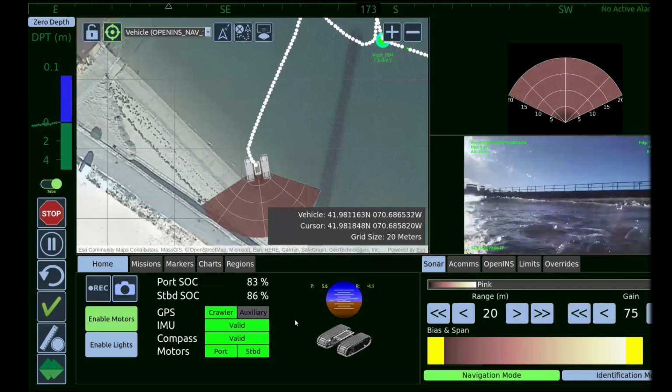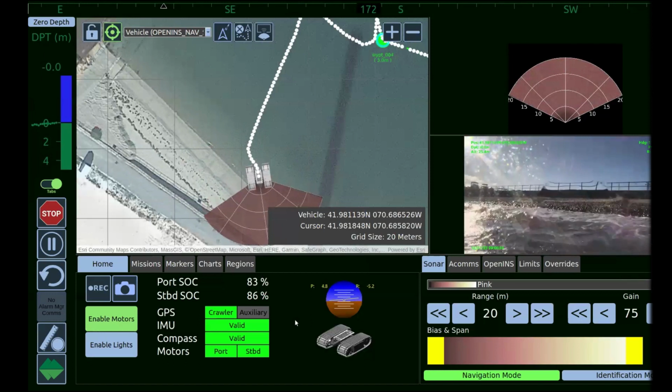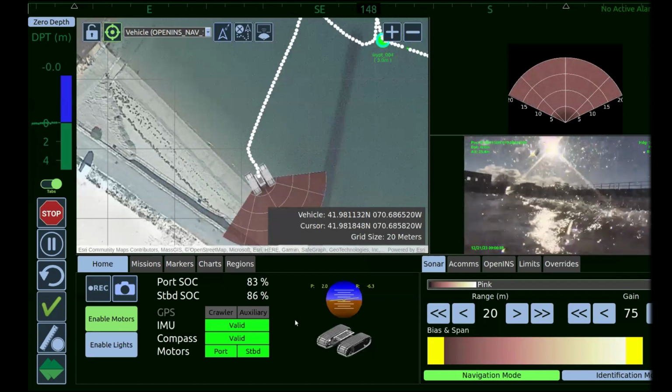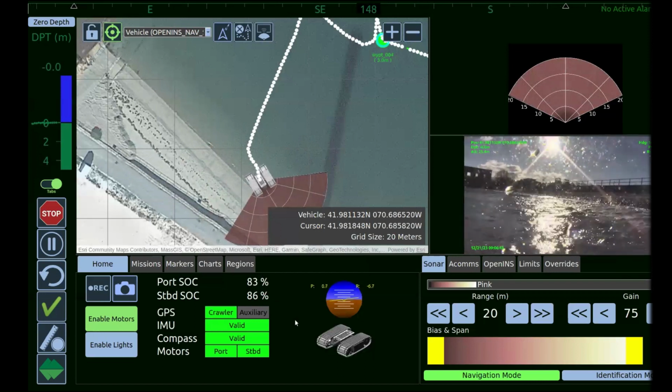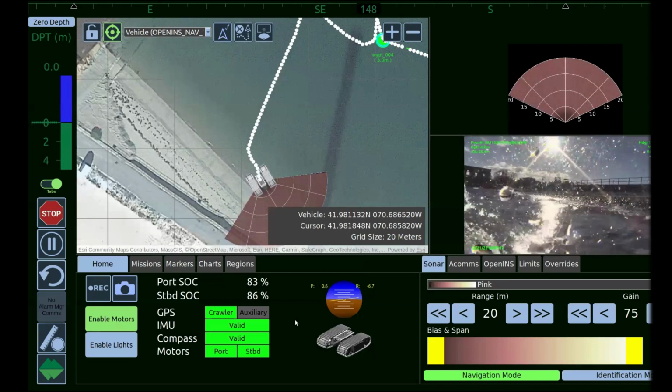The vehicle has about 220 kilos of tow force. If you translate that into payload, you can put anywhere between 200 to 300 kilos on top of the vehicle. It's a very, very rigid structure, so the limitation is the ability of the tracks to actually propel that payload across the beach or into the water. But we do have to take into consideration how high up that payload is and where the center of mass is, and things like that.